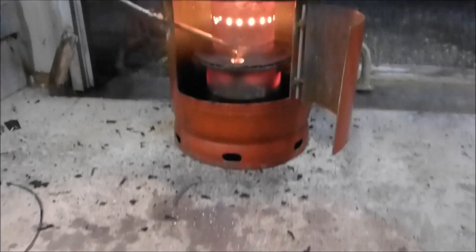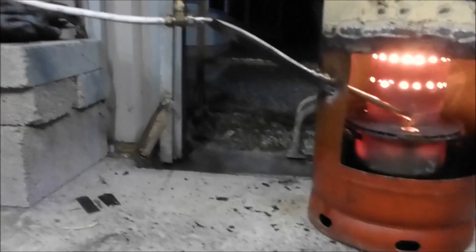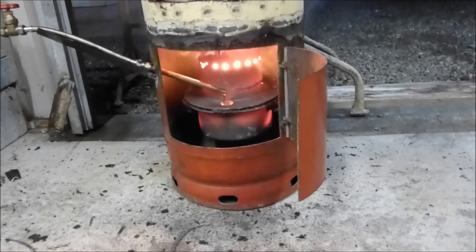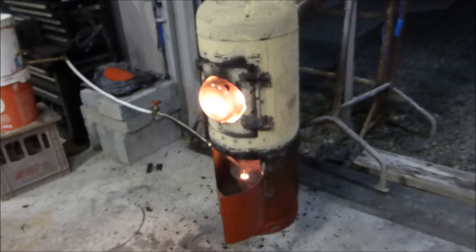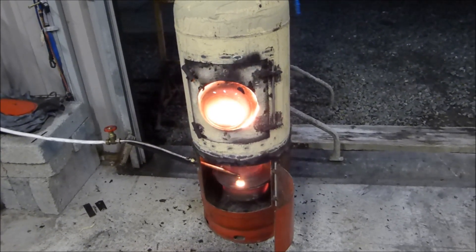The reason I put the bottom door on was because I want to use it as a dual stove, so I can burn wood in the top bit if I want. And in order to do that I need two doors. But I tell you what, this thing is giving out savage heat — absolutely savage heat. I had no baffles in there yet either. I messed around with this today, got close to completion, and I couldn't wait. I thought, okay, I'll just do a temporary run and stick the oil into it and get it burning. Wow, brilliant.